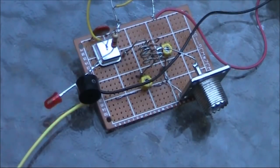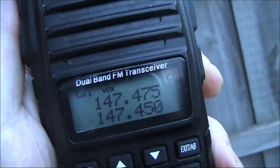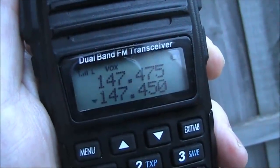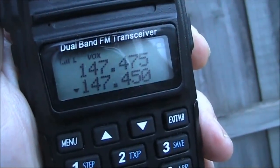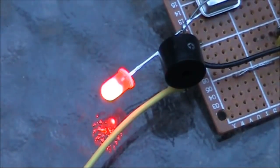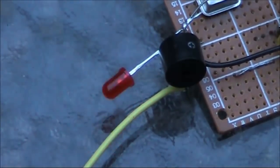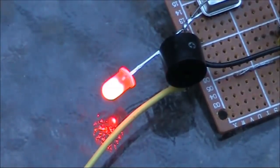One variant is you can wire a piezo buzzer across the LED. A benefit of that is if you're using an FM receiver, as the buzzer causes some modulation to be impressed on the carrier. Note that it's a piezo buzzer. Piezo transducers often look similar to buzzers, but a transducer requires an oscillator circuit to drive it, whereas a buzzer is self-contained.